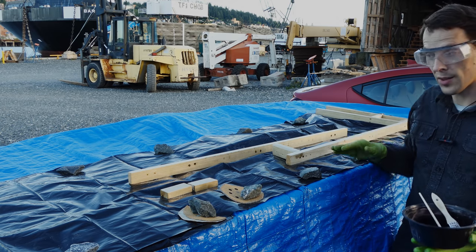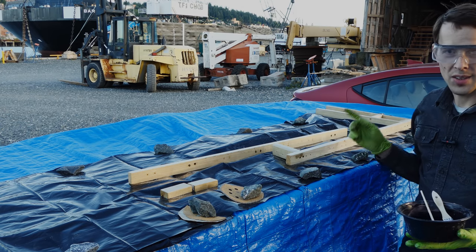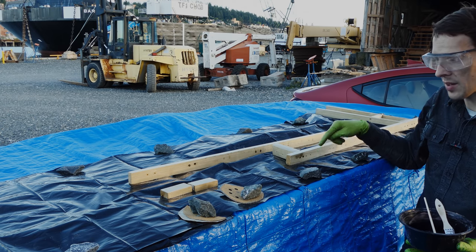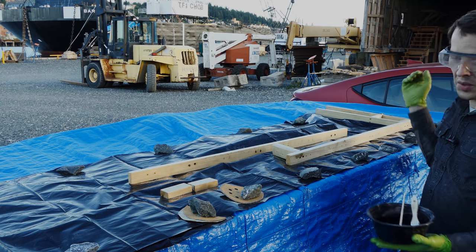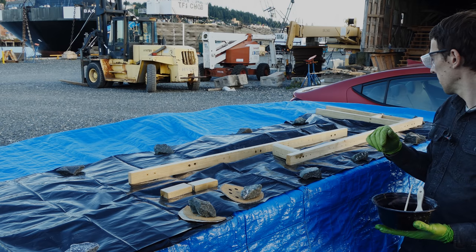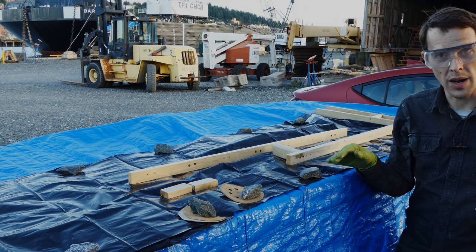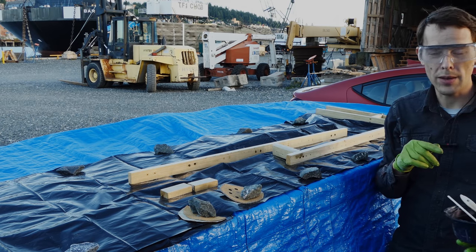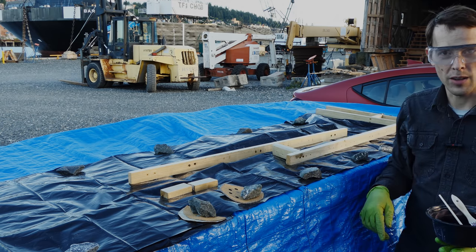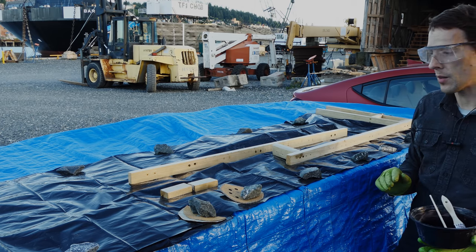This isn't going to be the greatest surface because my plastic bag is all crinkled up, but what I care about is that the finish cured epoxy isn't going to stick to the plastic bag, and I can just peel it off when I'm done so I can paint every side in one go. But if you care about the finish, your bag has to be perfectly smooth, otherwise you'll get little waves or you'll get funny speckle patterns or lines where ridges are in the bag. So yeah, if you're expecting a great finish from this, maybe not the best way to do it.